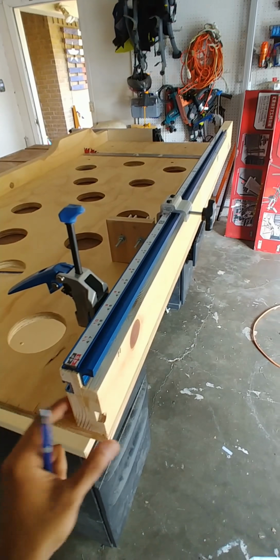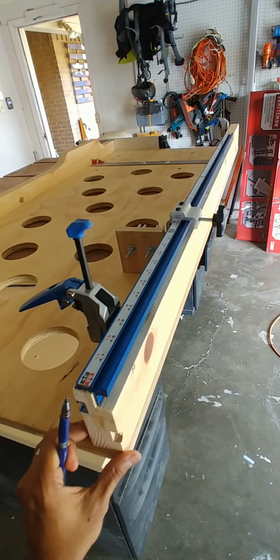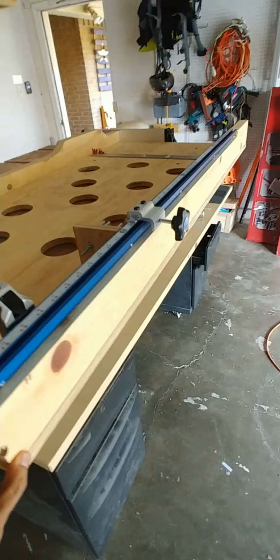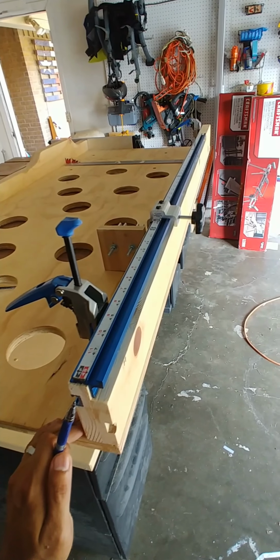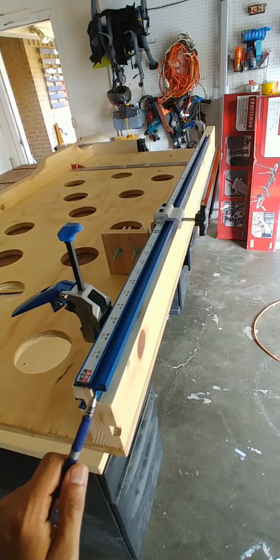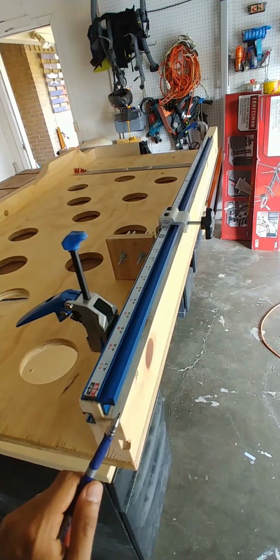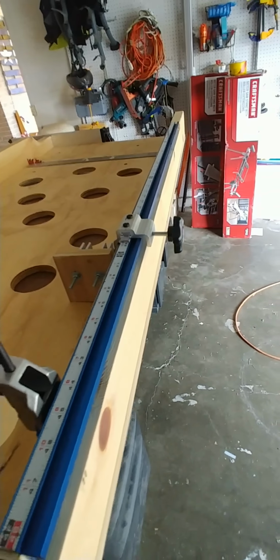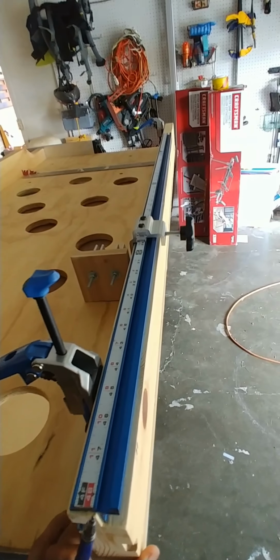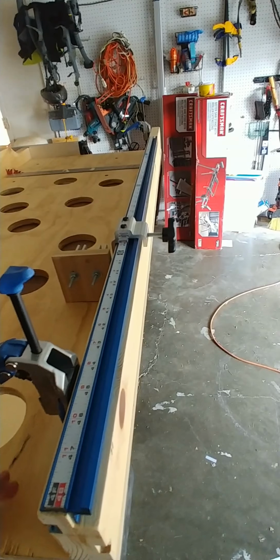I'm not going to go into details of that in this video. I will post a couple of my favorite links that I found that explain the 5-cut method very well, and I'll post that in the description. But the 5-cut method is what will make or break this slider's perpendicularity for making a crosscut. So that method has to be followed, and you need certain tools for that, which is also explained in the video. I will post it in the description.